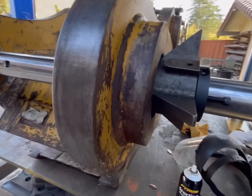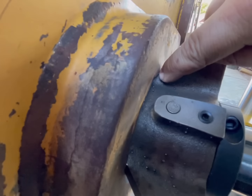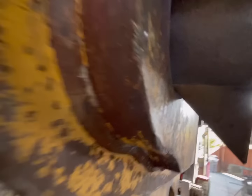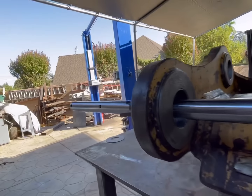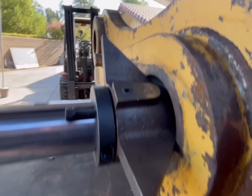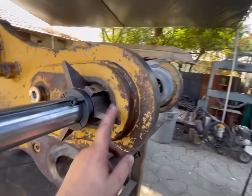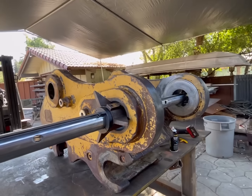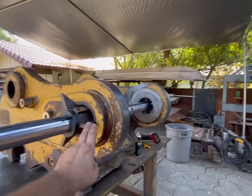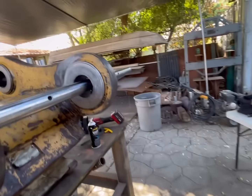And when I'm doing my centering cones, I just look to see that they're all touching on a bore that's pretty straight already like this. It's pretty much a good circle. It's just a little bit messed up. You can see those are all touching. Now, this is not an exact center. This gets it very close, and then you do your final adjustment after you get your bearings tacked on.